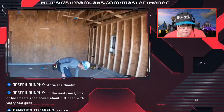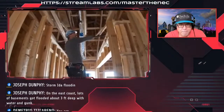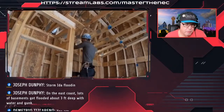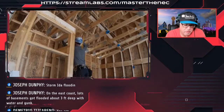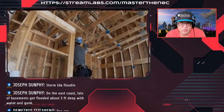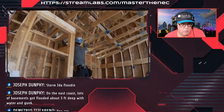Going outside of this wall, I want to go ahead and pull out some. And I have another ladder on the other side of the wall. Obviously, we're being careful how we're routing these cables, looking out for scuttle holes, looking out for where I might be within a certain distance, whether it's 6 feet or 7 feet from the scuttle hole, depending on whether or not I have a pull-down access or just a simple scuttle hole. It's going to make a difference. So I'm thinking about all those things when I'm pulling those home runs and keeping that in mind. And I'm sure he is doing it as well.